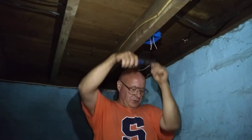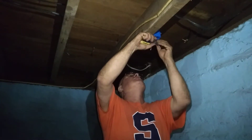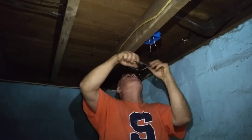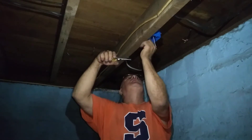So we're getting this electric heater taken off that was on one side of a 220 circuit. The dryer was 30 amps and the heater was only for 20 amps, and they hooked it up against code.